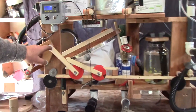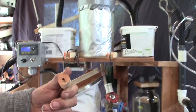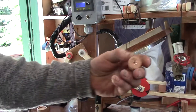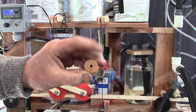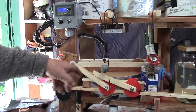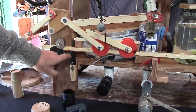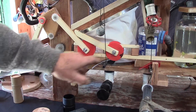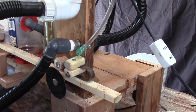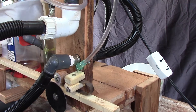All these are just screws through a piece of wood, and I put a piece of quarter-inch copper pipe through the middle of it to cut the friction down. Each one of these has a little copper bushing in there — just stuff that was laying around. These are made with a hole saw. After I put the bushings in here, it was too loose and it wouldn't work, so I had to put a spring. There's a spring in here for tension. And there's another spring over here, which is a piece of recoil spring, just giving it a bit of tension to hold it open long enough until this can get back and close it.